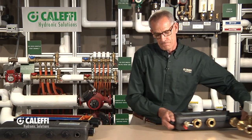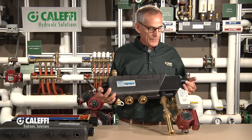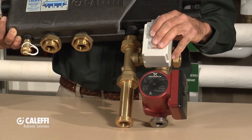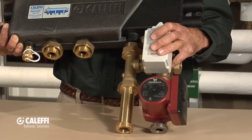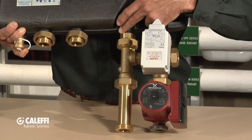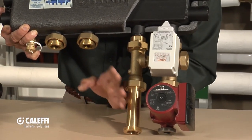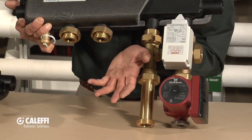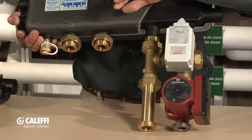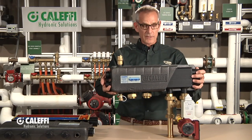Let me take it a step further — this is the mother of all HydroLinks here. We've made it convenient for the installer to put on our hydro mixers. We've got a pump, a mixing valve here with a motorized drive on it. You can put a floating 24-volt signal on that — control it possibly with a Taco or whatever brand you like — and that'll modulate and give you a mixed temperature off of this. They bolt right up and you put the union halves on there with big union nut connections. You can put multiple ones on here and have different mixed temperature zones going out for a radiant job that might require a couple of different temperature mix stations. You could also take a high temperature loop off of this, because every one of these take-offs is going to receive the exact same temperature fluid. That's what it looks like assembled with the jacket cut away to show the finished product.